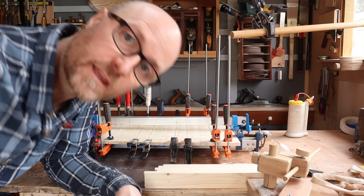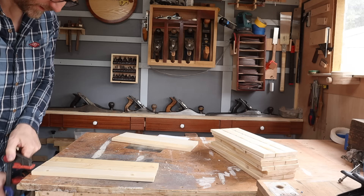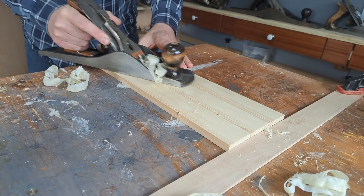That was frantic, but it'll get the job done. These have come out of clamps now. If you've got a thicknesser, send them on through. You can do it with a sander. I'm just going to quickly plane them all down, mainly because I quite like planing pine. Don't take too much off because they're already quite thin, and then we're going to cut the sides and get it all glued together.